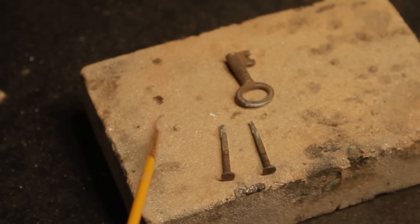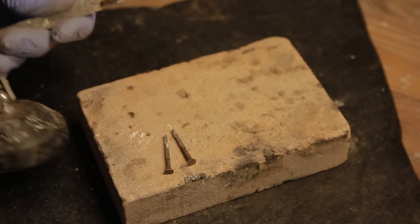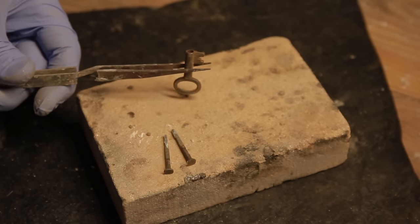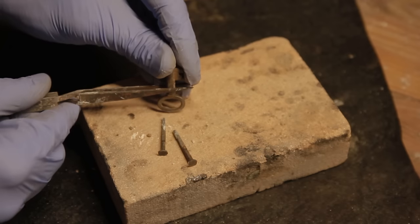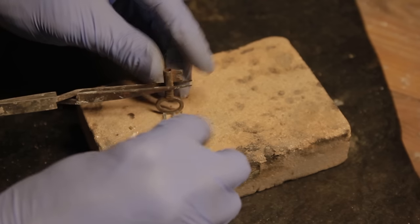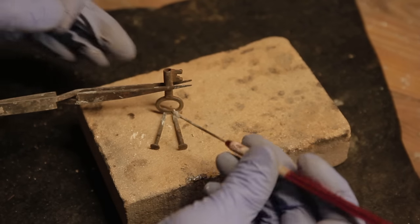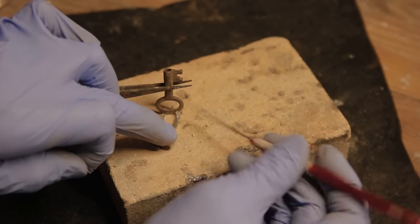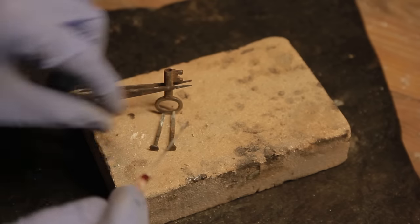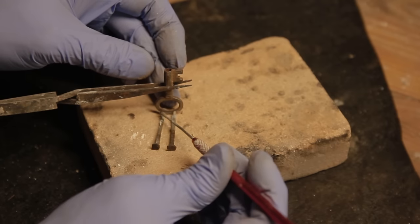You put flux on the metal pieces you're joining, and you also put it on the silver solder itself. Now this is the part where it gets a little bit tedious — you want to set up your work so that it's going to stay in place while you are torching and joining it. Take your time on this part and get everything set up nice and good. In this case my little key man is going to be sitting down, so I want to get him fixed up as close to that position as possible. Then go ahead and set your silver solder right on the joint where it's supposed to go. Patience is going to be key right here.